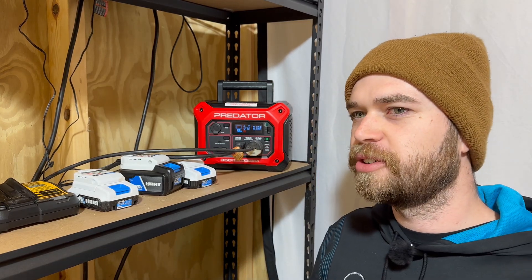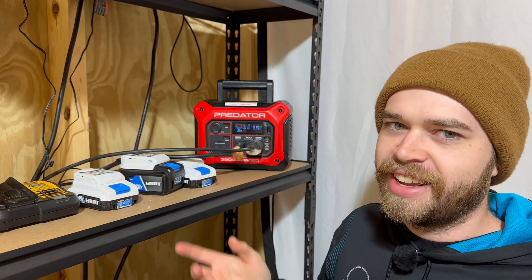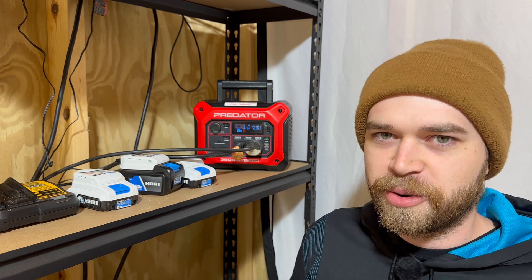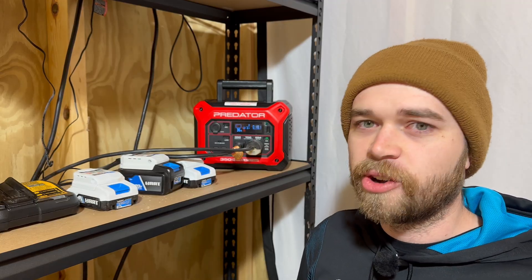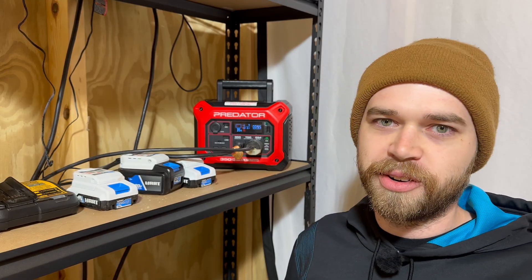You may have noticed I'm not getting 100 watts in even though I have a 100 watt solar panel. That's because sunlight fluctuates — you're really only getting peak, full charging for about an hour or two of the day. When the sun is rising or going down you're not going to get nearly as much charge. Even with a 100 watt panel, a lot of days it'll max out at like 80 watts, and it's pretty rare that I actually hit 100 watts. Some of that comes down to placement — mine is just sitting on a little shelf. If I angled it perfectly I might squeeze out a bit more, but just know the output is going to fluctuate a lot.